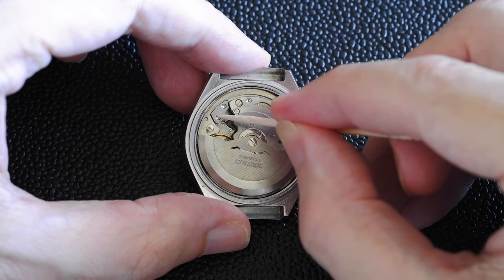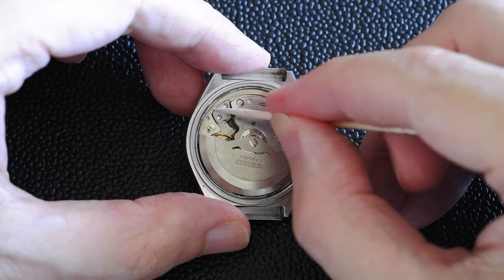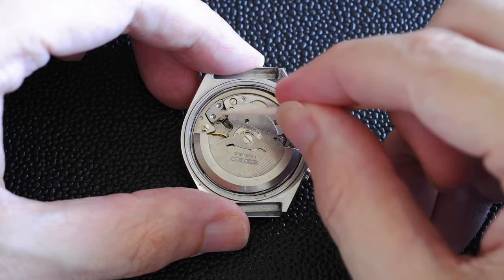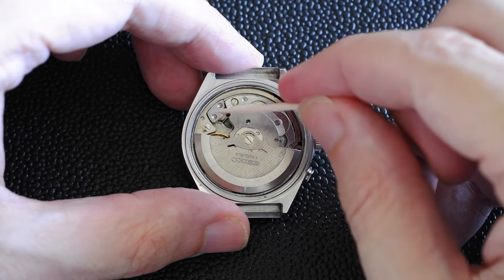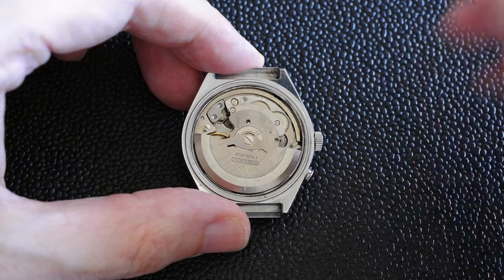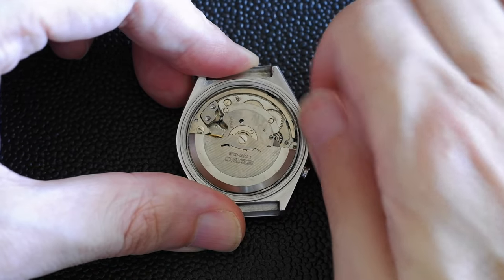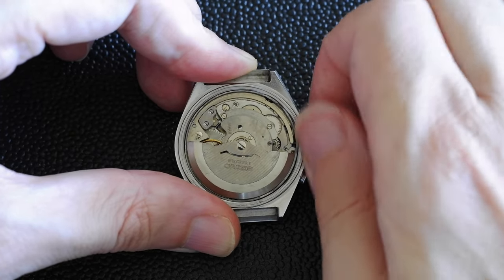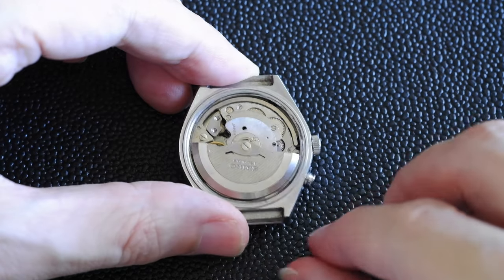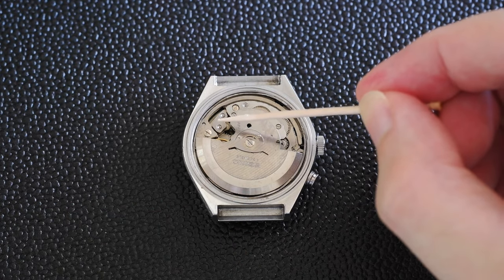This is a little hammer thing and it's currently not set, so although you can move it it's spring-loaded and just presses gently against that. When we set the watch and pull this out, that's going to release and be ready, and then when the alarm actually goes off this is going to vibrate and hit that alarm spring and make the sound. So I've set the time, I'm now going to wind up the alarm mainspring — there we go — and set it, pull it out. The little hammer thing there is ready for when the time comes.